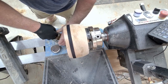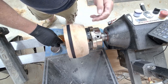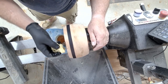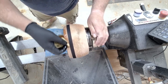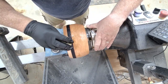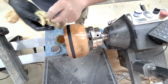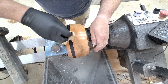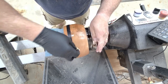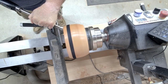In the video now I've got some sanding sealer — I always use this on my pieces. It kind of locks the grain and prevents any further degradation from tear-out too. It does help a lot filling up the very small voids and cracks in the bowl, so when the finishes go on they're not soaked up in the cracks and grain. The sanding sealer does the job for that.